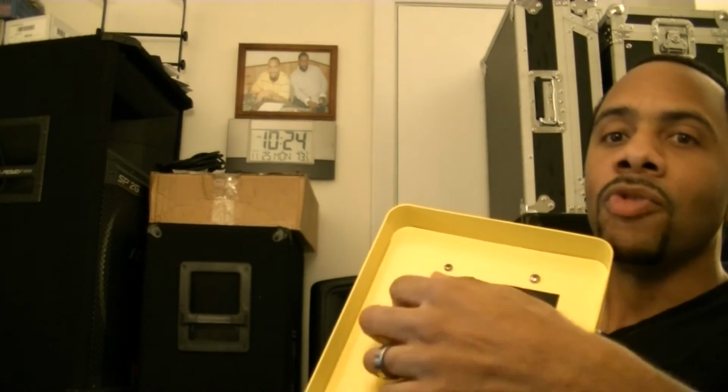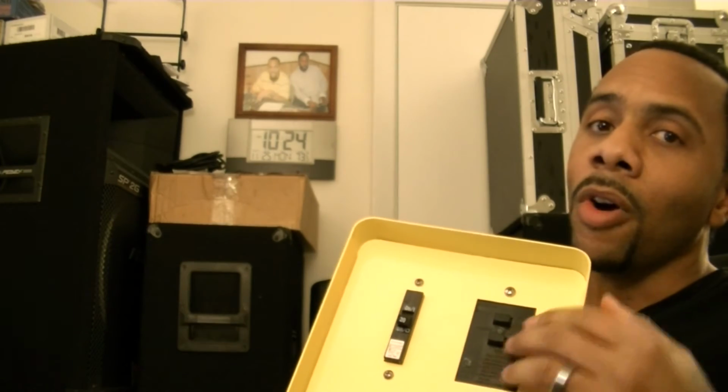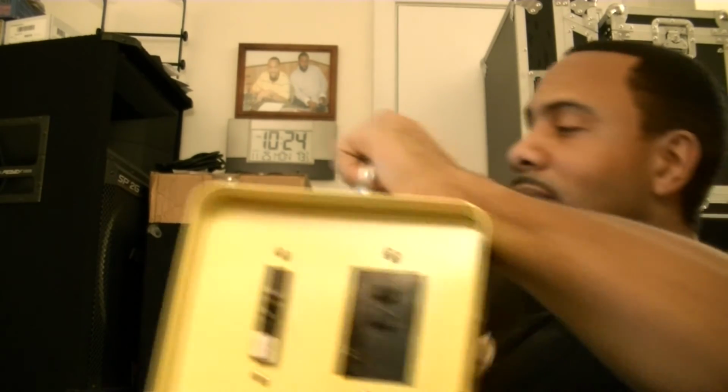When that current goes up, usually you start tripping breakers or ground fault interrupts. Any of these safety circuits will start tripping. Or some of your devices will have glass fuses. Fuses will pop because when the current pushes harder to get that power through there, the current is working harder, heats up, and pops the breaker. Now some of your pieces of gear might not have fuses. And in that case, you start ruining components on that circuit board. Capacitors, voltage regulators, all kinds of stuff starts to fail and overwork hard. It shortens the life of your gear.